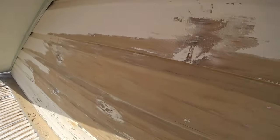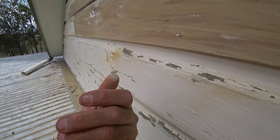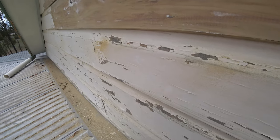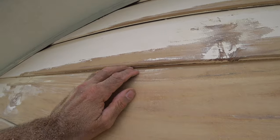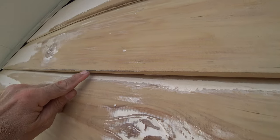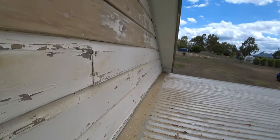This wasn't good — see that powder? Do not paint over it. It has to be washed down as well. So I'm doing the sanding, and then this will all be washed down. I've done these bottom edges — you can see the little arrows along the edges there. I've got three boards left and the bottom one's down low so it'll take a little bit.